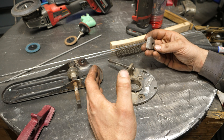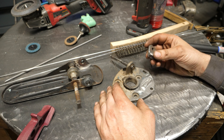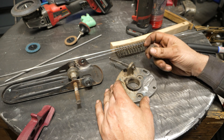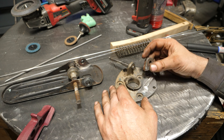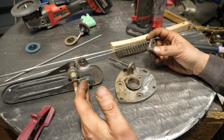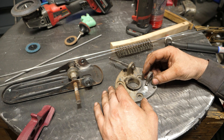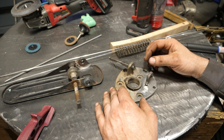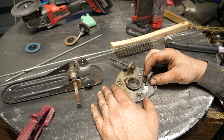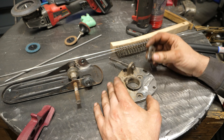The first thing you need to figure out is what the part is made of. I can tell this is cast aluminum simply because of how light it is — it's not going to be cast magnesium unless it came from NASA. If it was cast iron it would still be repairable, much like cast aluminum, but the preferred casting for repairability would be something like a non-high-carbon steel because that's the easiest to repair.